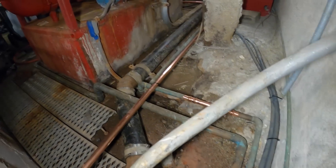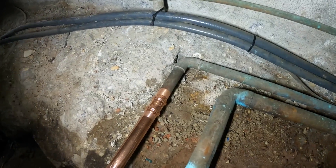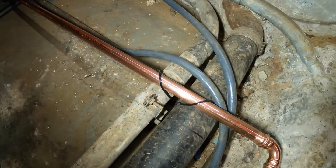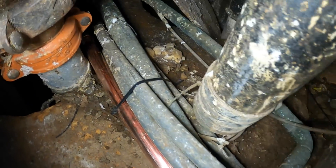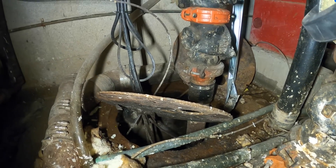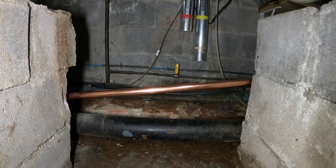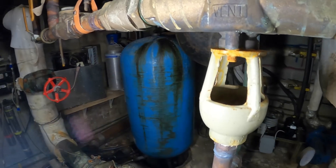Goes down — let me walk through so you guys can see. Now that line is separate from this line. Put a little tie wrap there. Follow the clean pipe — made its way through, tie wrapped it, bundled down with all these other drain pipes. Put a tie wrap there. I'm going to go straight down — I don't like how it kind of sticks out over there, but I'm glad it has a nice pitch so it's going to drain. Now when that line drains, it's not going to back feed — we solved that issue.